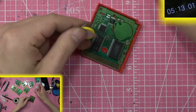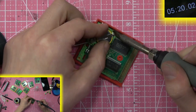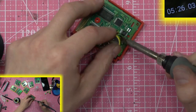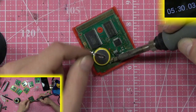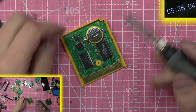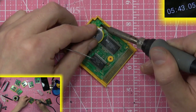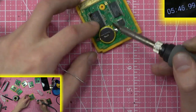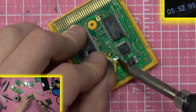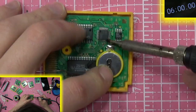We're at five minutes seven seconds — now we're adding flux to both points and adding our battery. Let's see how fast I can solder eight batteries on. Oh, Pokemon Red's giving me trouble — it's wiggling. We'll come back to it, do that one last. Gotta make sure I get my flux on there and then just tin the pad and slide it in place.